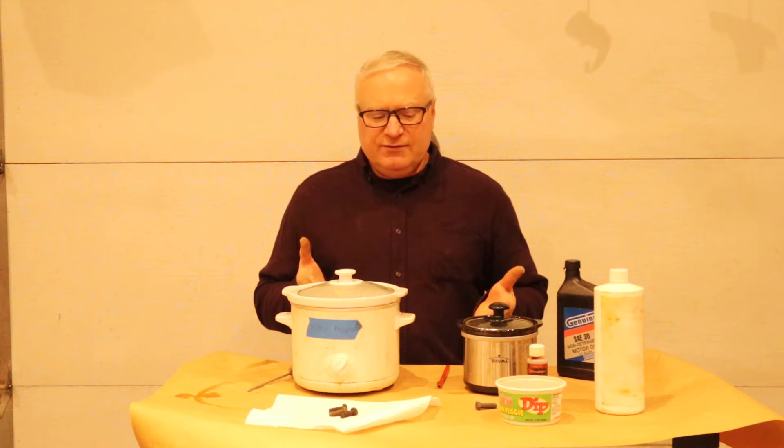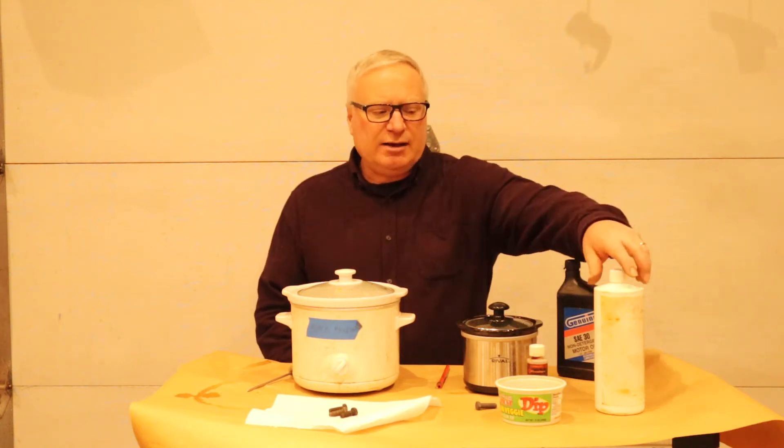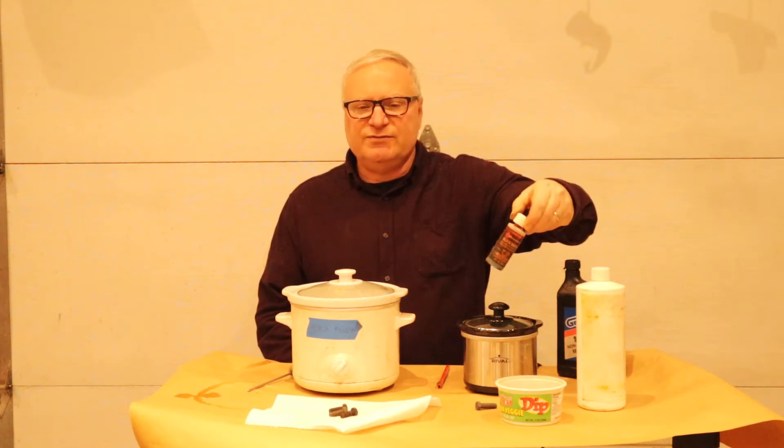It's really simple. I have a couple of crock pots here filled with distilled water and a couple of chemicals available at most shooting supply stores — there'll be links in the video for where to buy these. I like to buy a larger quantity of the gray phosphate and then buy some cold gun bluing. If you mix these two together that will give you your black phosphate, whereas if you buy black phosphate you can't make gray, so you'd have to buy two separate containers.